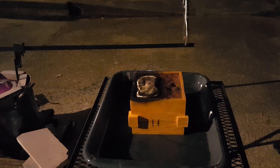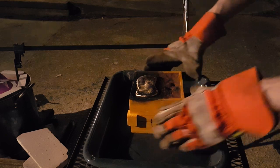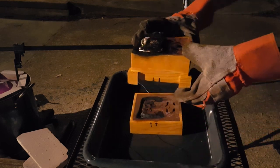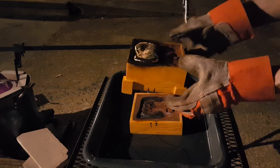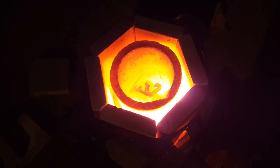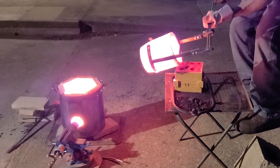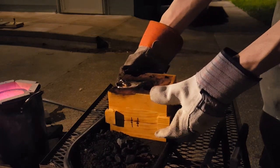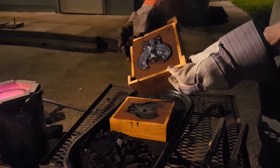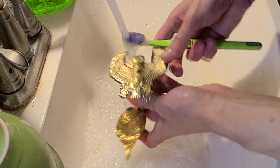One characteristic of aluminum bronze is that it does not like to flow into tight spaces, and this was a very shallow mold. So — drum roll for disappointment or excitement — it didn't flow. Well, I'm terrible at quitting, so since the furnace was still hot I threw the metal back into it, made another mold, melted it all over again, and gave it another try. And again, prepare for disappointment — and it filled the whole thing. I could cry.